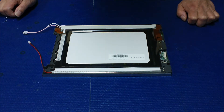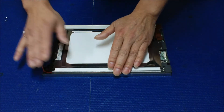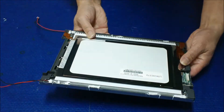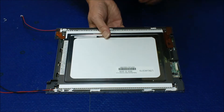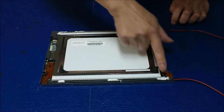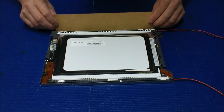I do not recommend using hot glue, because when the LED strip gets a little bit hot, it's not going to melt the glue, but you can smell it. So I would suggest just putting some silicone. Here's a sample I already prepared for these instructions. You see — one, two, three on each side. After you add the screws and let the silicone dry, you just cover it with aluminum, a little bit wider aluminum.